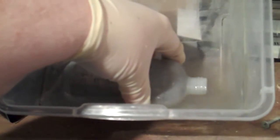process, and it's on one of your parts, you don't just want to take the Cerakote off by tossing it in acetone and just cleaning off the coating. What you want to do is make sure that it gets partially cured in the oven for only about 20-25 minutes, and then you just sandblast it off like I did. You don't just clean it off because the coating's already penetrated the metal in the little microscopic valleys of the metal where you sandblasted it.